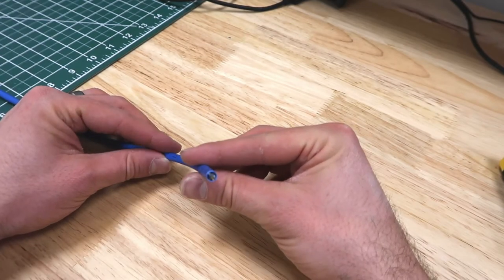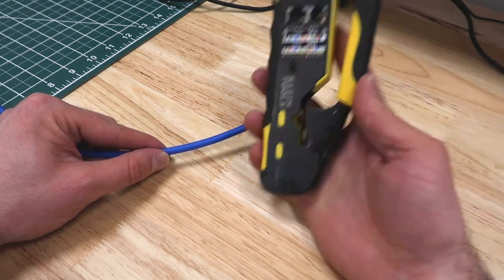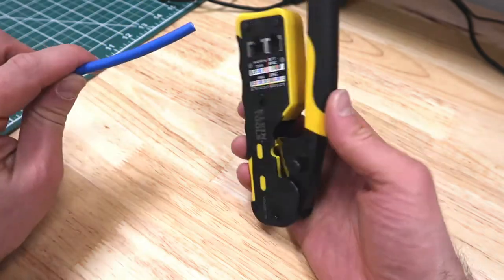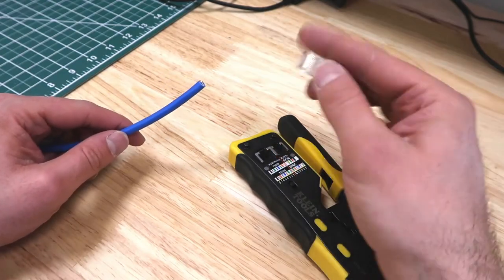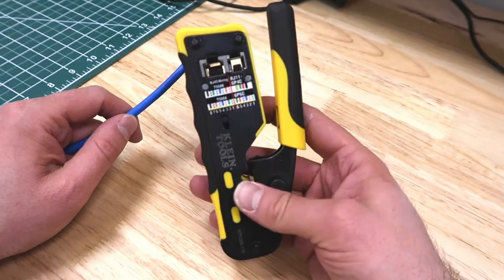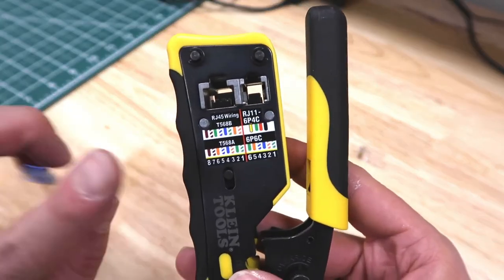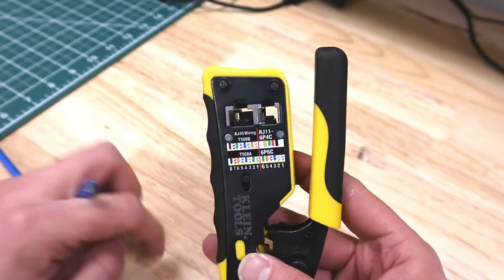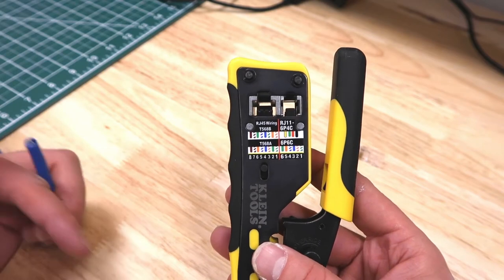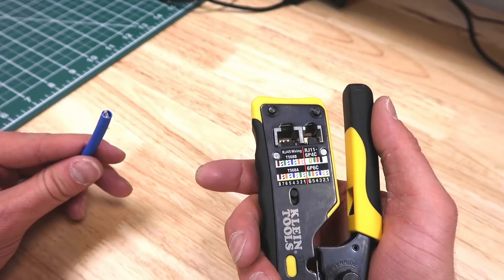Here's the other end of that wire. This is a rare situation where I get to sit down and crimp it. If you're a hobbyist like me doing this for your home network, get one of these pass-through crimpers. You strip the wires down, throw on a pass-through style connector, and crimp it down — you don't have to worry about getting the wires just the right length like with the traditional style. If you're not doing this professionally day in and day out, highly recommend it, it makes things so much easier. My whole house was done in the B style — there are two styles, and all that really matters is that they match on each end.